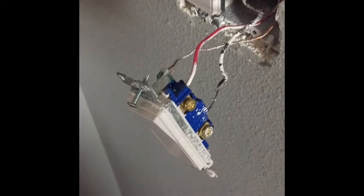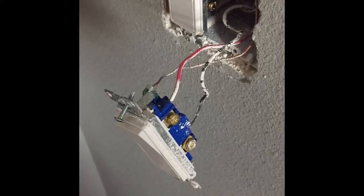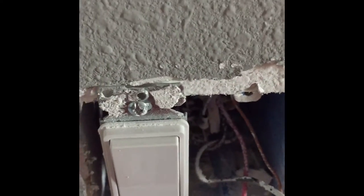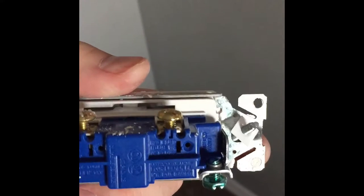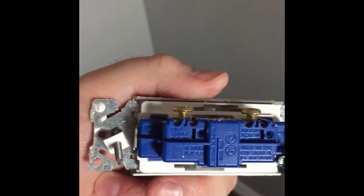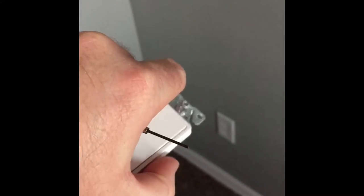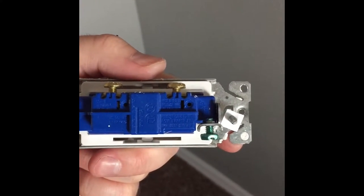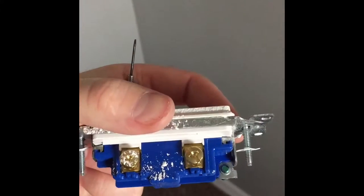We have our ground there, so all we have to do is pull this out of the box, get it taken apart, and wire the new switch in. We're going to leave this switch in place as this is the fan switch. If you have this particular switch setup, press in the slot there to release the wire — I used something small like this little flat-head screwdriver. You have to maintain constant pressure on it and pull the wire out at the same time, and it comes right out.